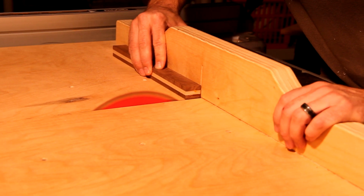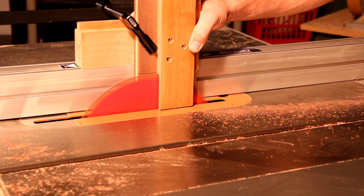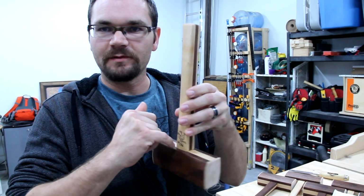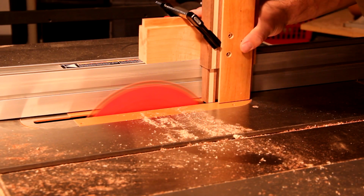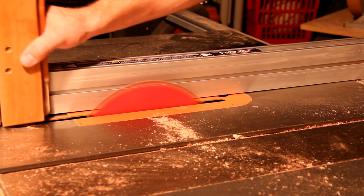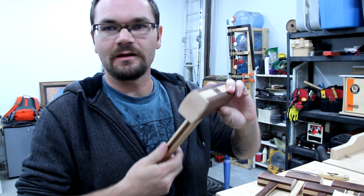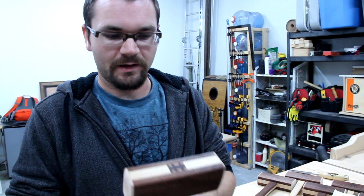And then I used the simple jig for cutting tenons. So I more or less cut a little bit off around every piece of the handle, so then it would fit into the head. I lowered the table saw blade just a little bit, maybe 1/8 of an inch or maybe 1/4 of an inch, so it wasn't all the way to the base of the head. And I cut 2 slots in the middle of it, and that is where I plan on putting my wedges.